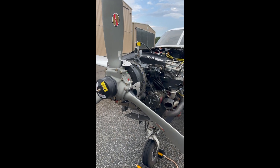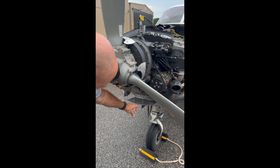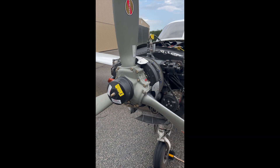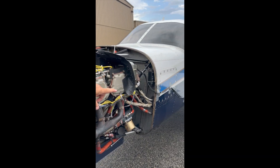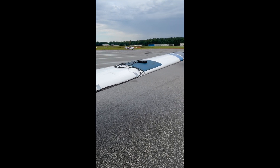One of the things you want to make certain of is that anything loose on the engine is tightened up. Down here we've actually safety wired anything loose, tied up some hoses, made certain things don't flop around. We've got the cable to the sensors cable-tied to the engine and then duct taped to the wing out to the box. So now let's walk out to the box and walk you through some things.